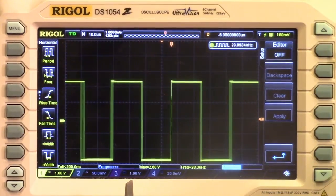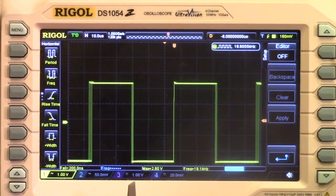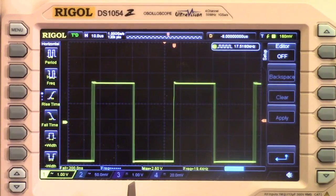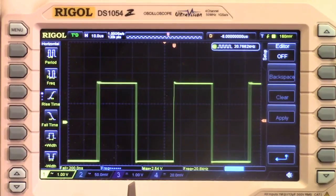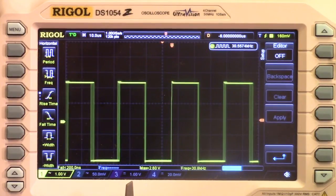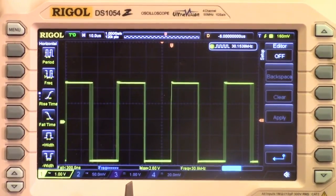Now if I get up, as I did before, we would expect a drop in frequency as we did before. Okay, he goes down to 17 kilohertz. So when we're set to blue, he goes from 17, just in open air and reflecting off something that's not particularly blue, like my shirt, just a little bit blue, to 30 kilohertz. When we had him at red, he jumped all the way from 35 to 85 kilohertz. That is really interesting.